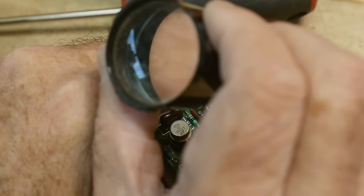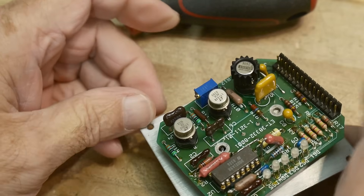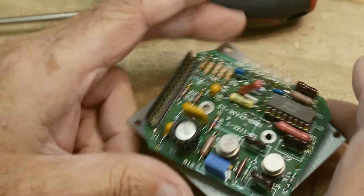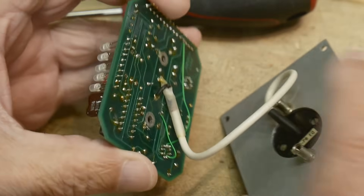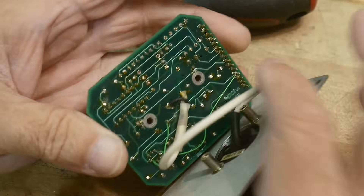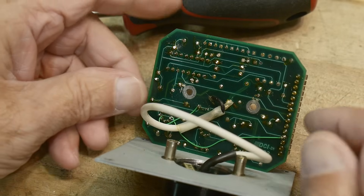The OPA101 must get toasty. So we're going to have to pull out the data sheets on these and take a look at what's going on here. This is the DG201 FET switch. There's a shielded wire here that goes to the photodiode — just two wires, a diode that goes onto the board. Yeah, it's clearly a four-layer board.